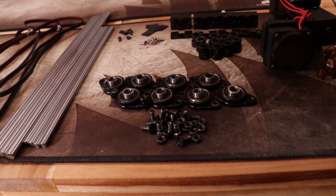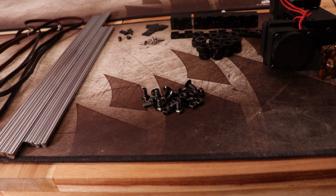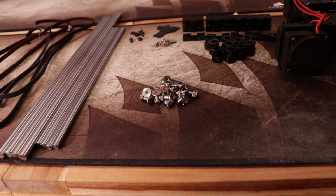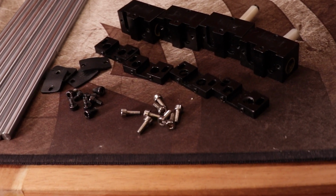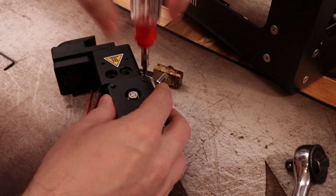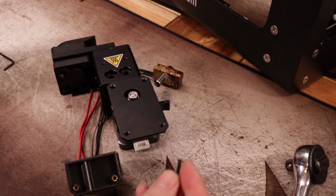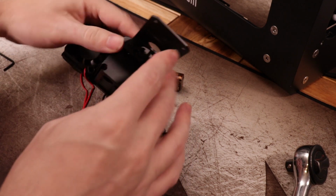At this point, I went ahead and replaced the M5 fasteners that mount the bearings to the case. The ones that came with the printer are pretty cheap, so I upgraded to some stainless steel ones with self-locking nuts. I also replaced the screws that hold the 2 halves of the slides together. I went ahead and removed everything from the main block of the extruder. This part isn't mandatory, it just makes the alignment a bit easier because the printer's able to sit flat when it's upside down.